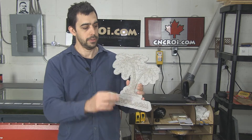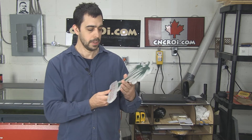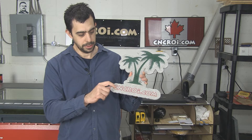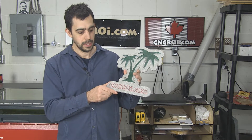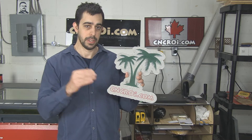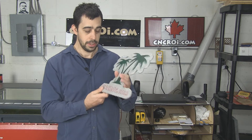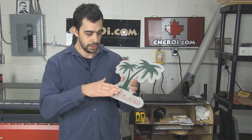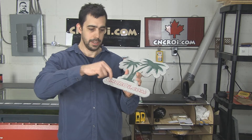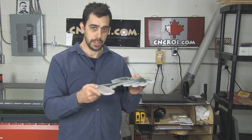For this here I use a 1/8th straight double flute bit and a V-carve bit at 60 degrees. On this one here I could possibly do this with a 60 degree bit just going slightly into it, but I would not have the straight-in angle that I achieved with the laser, because the laser does not use a round bit going into the material. The other advantage to a laser is that there is no surface contact — it's just a beam of light hitting it and vaporizing it, spot by spot.